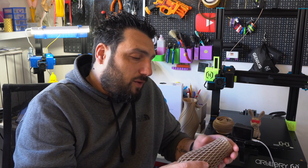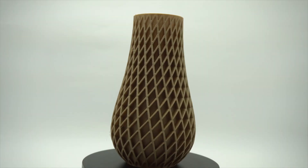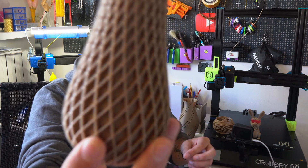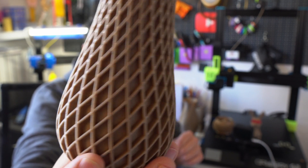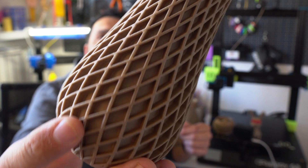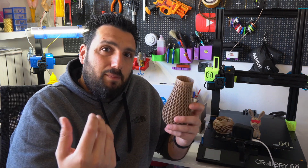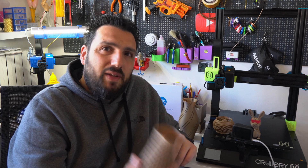The last vase was a bit of a challenge — I wasn't sure it could be printed in vase mode, it was an attempt. I slowed the speed down from 50mm/s, which I usually use for wood, to 35mm/s, and the result really surprised me when I saw it finished on the printer. This is entirely printed in vase mode. All the links to these vases and models will be in the description. This bamboo PLA printed even better than the previous Azurfilm wood I tested, and I had more filament to work with this time — I really liked it a lot.